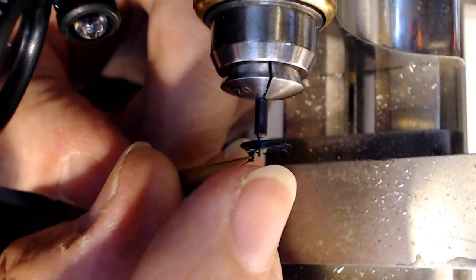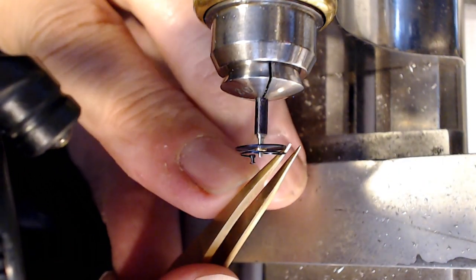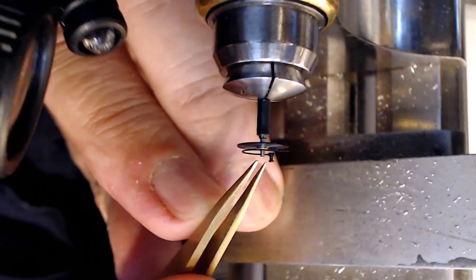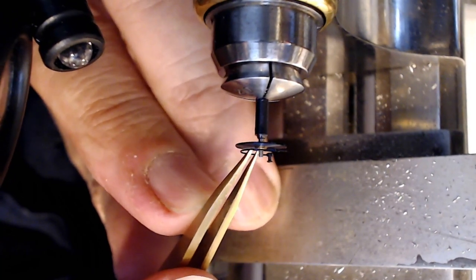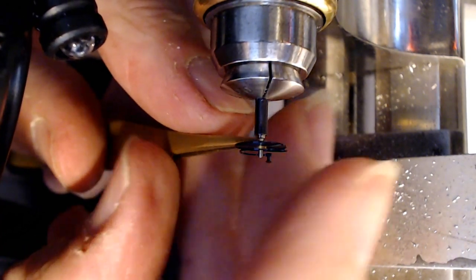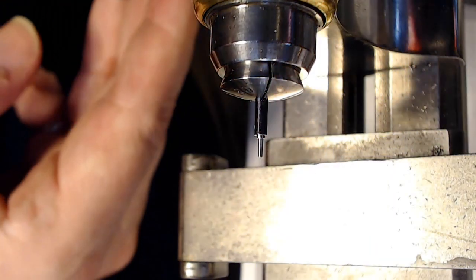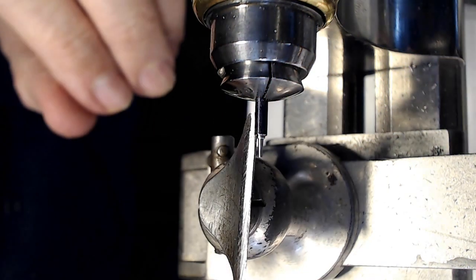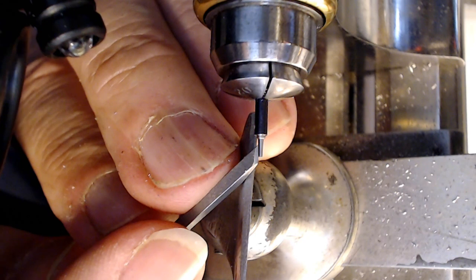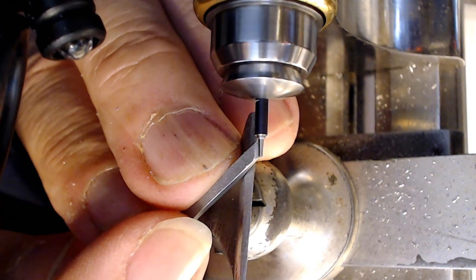So there's the hairspring sitting in there, and let's see if it got past the hump. I want it to be just a bit past that stupid hump, because when I pound that hairspring in, I don't want it to be, nope, it's still sort of stuck there. I don't want to spread it out too much when I pound it in place, right? Because I'll have a whole other issue here. So all right, a little more, just a bit more. I can see it goes right up to here, and then I want it to get past that, so I'll just shave off a bit here.